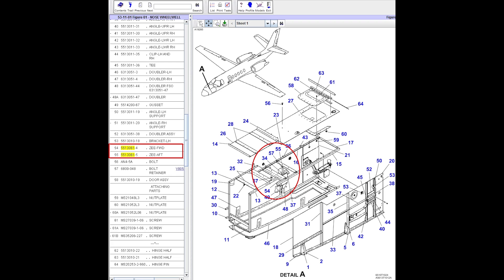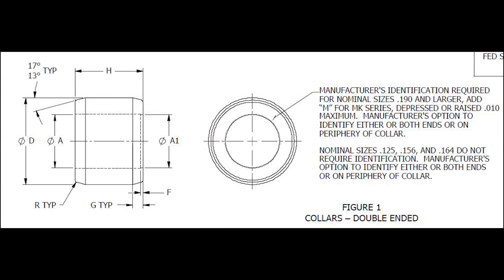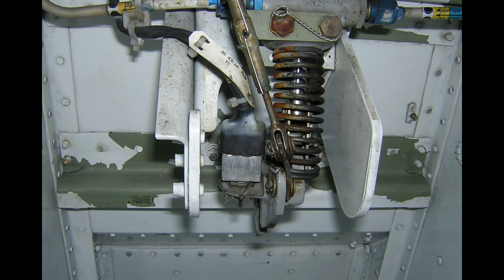These brackets were originally installed with huck bolt type NAS 7034-H03 pins and NAS 1080-K04 collars at the outboard ends. These fasteners utilize a swage type installation that requires huck tooling, making field replacement difficult due to limited access and tooling requirements.